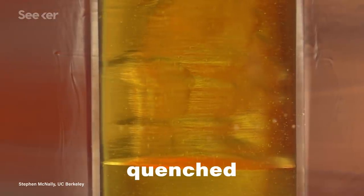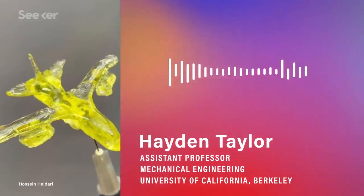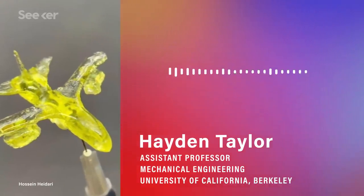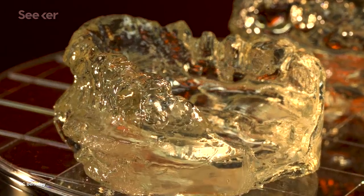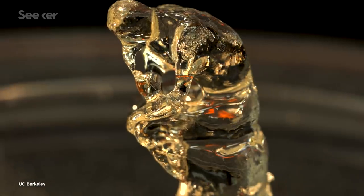First, the reactive molecules could interact with the oxygen and become what is called quenched, so that the reactive molecule stops being reactive and is basically dead. When there's a threshold for light, it's really the presence of oxygen that creates this sharp threshold — you've got to consume the oxygen before you can do the solidification. This is extremely important because technically those rays of light are going through the entire resin, even the parts you don't have to solidify. The acrylate in the polymers goes through polymerization, where resin molecules link together in chains to make a solid plastic. Within a few minutes, the researchers have a solid small structure like that of The Thinker.